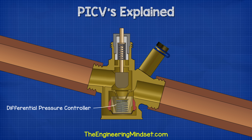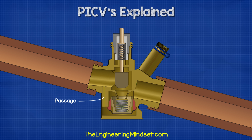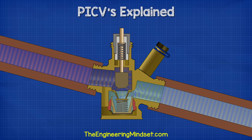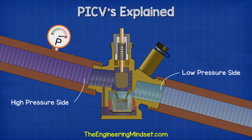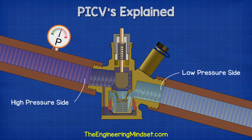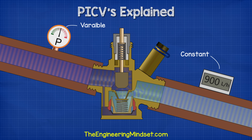Now let's look at the differential pressure controller. This model valve uses a small cup known as a shutter, which rises and falls to compensate for fluctuations in pressure within the system. The shutter sits concentrically within the guide to ensure it slides up and down correctly. A downward force acts on the shutter by use of an internal spring, which is held in place by a support frame. Underneath the shutter is a flexible membrane which acts as a physical barrier between the high pressure inlet and the low pressure outlet. A small passage connects the cavity on the underside of the membrane to the inlet — so when water flows through the valve, some of it flows into this small hole and the pressure of the incoming fluid forces the membrane upwards, pushing the shutter up to maintain the pressure difference across the valve. The spring helps maintain the correct force and pressure difference between the two sides. Between the pressure difference of the fluid and the force of the spring, the valve reaches equilibrium constantly and instantly as the system pressure changes, allowing the flow rate to be maintained regardless of pressure.